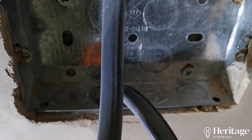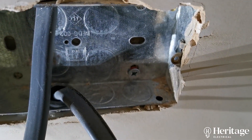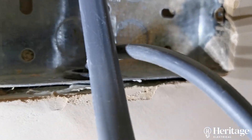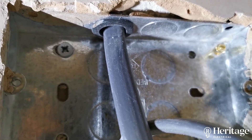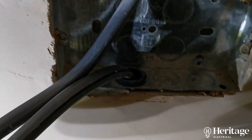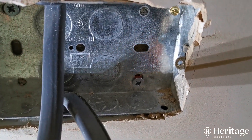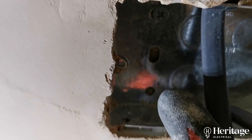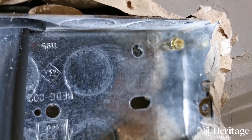You can see all the blanks are still in the box that aren't being used, whereas a lot of the time we get sockets with all the knockouts out and plaster spewing into the box, or there are holes where bits of stuff can get in. You can see where the cables come into the box it's all grommeted, whereas a lot of the time there are no grommets so cables can get damaged on the metal as they enter the box. There's an adjustable lug on one side, a fixed one on the other, and your earth screw at the top for bonding the back box.